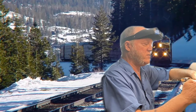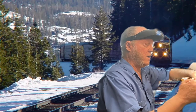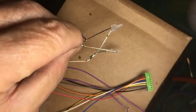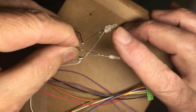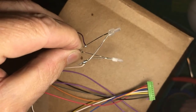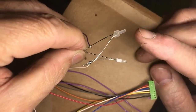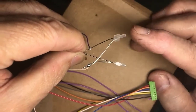If you had two resistors here, let's say they're 5 ohm resistors, the current would come through the 1K resistor, and then the current would share neatly between the two 5 ohm resistors. LEDs don't act like that. One of them would turn on and start conducting and hog all the current, and the other one might not light at all. Or the one could hog the current and burn out, and the other one would then take all the current and burn out. It would depend on the voltages, currents, and the resistor you had, but they don't share current equally.